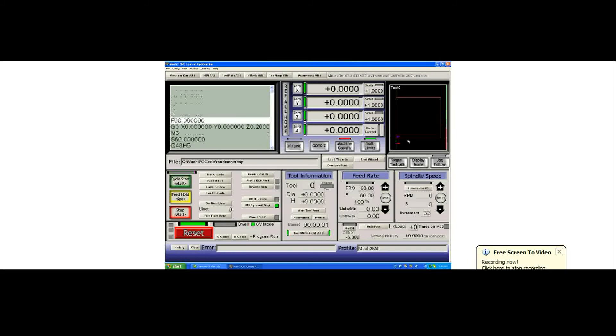Now we have our secondary system. Let's jog away from zero — we've got a piece of material on our table, so we jog up to it and move the Z down until we're touching the material. We then zero our axes. When I switch to machine coordinates, you can see the display showing how far we are from the home switches. Turning off machine coordinates shows the result of our G54 offset system. After regenerating the toolpath, our road runner is going to be cut at zero in the G54 system and at coordinates 32, 37, 16 in machine coordinates.